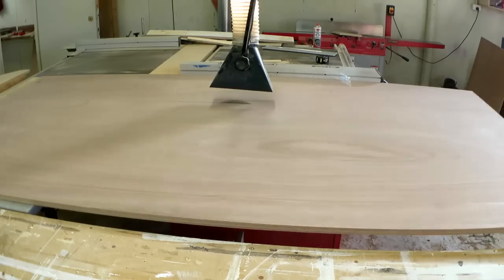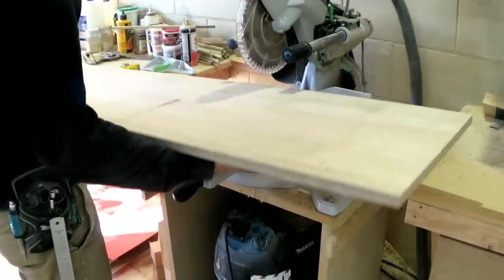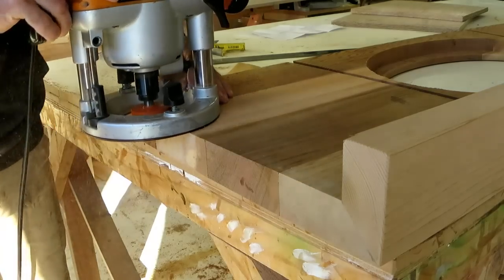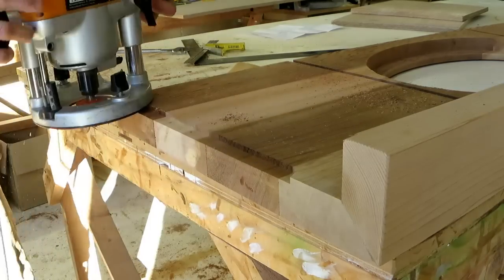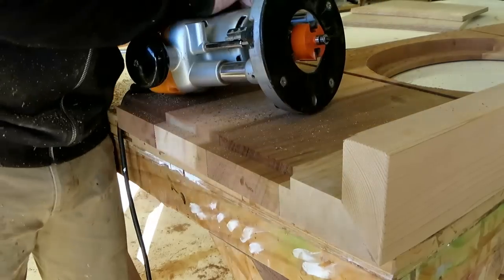And I've got a sheet of mixed hardwood plywood. It's pretty heavy duty, and it has marine glue, and these will make up all the carcass pieces. I should have made this rebate before I glued on the front and side. Anyway, I forgot, so I'm doing it now. I can't quite get all the way to the ends, but it's still going to work.